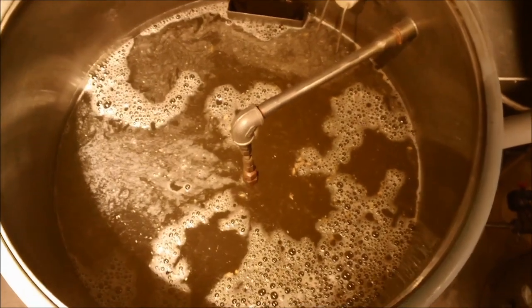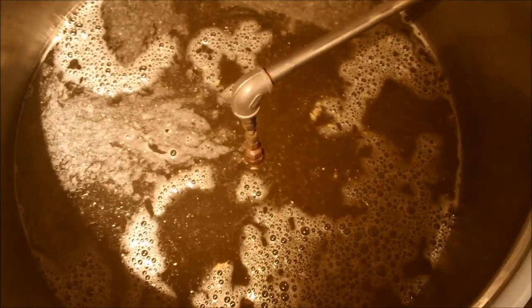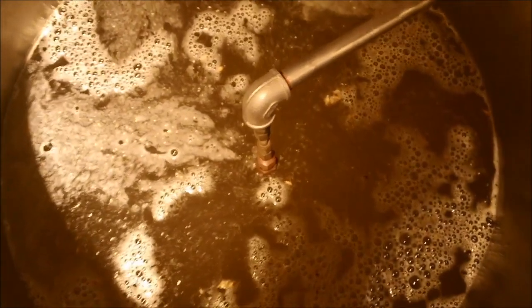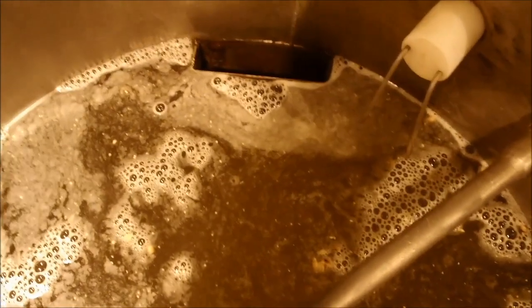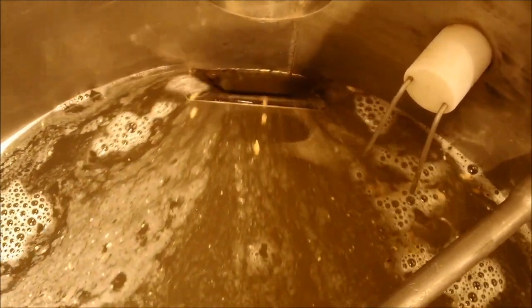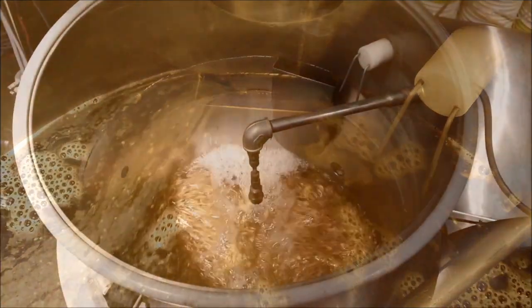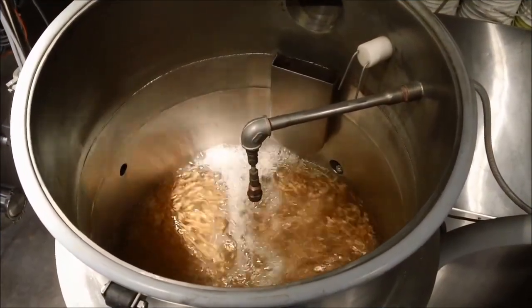It is very important to remove dirt and other impurities from the grain at the start of steeping. Dust, various microorganisms, and foreign materials are washed away from the grain by the overflow of excess steep water. The initial water also leaches some husk components that may impede germination. Agitating the barley at the start of steeping also helps with cleaning the grain.